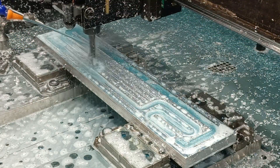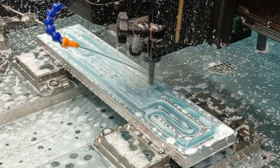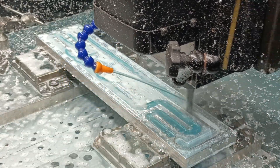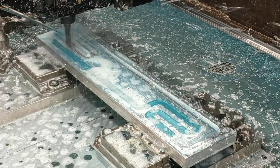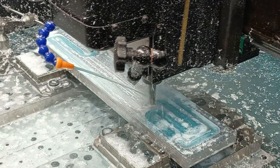The cut looks beautiful. I probably could go deeper, but it's only seven minutes — why risk it? I want to set this up so I could walk away. In the past when I was using the small end mill I had to stand here and constantly blow the slot out because I was slotting so deep.